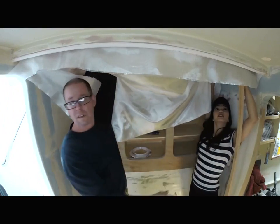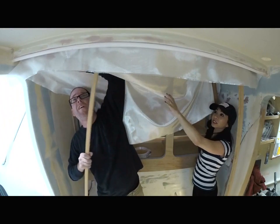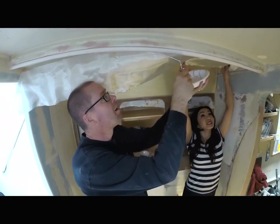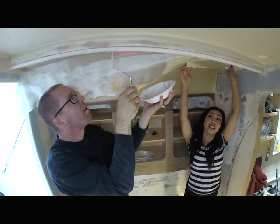We used a continuous 6-ounce fiberglass cloth that was 40 inches wide and 60 inches in length. We love using this particular ounce because it wraps and conforms very easily to the irregular shapes and angles of SV Basic. If we needed more strength, we would just add more layers.